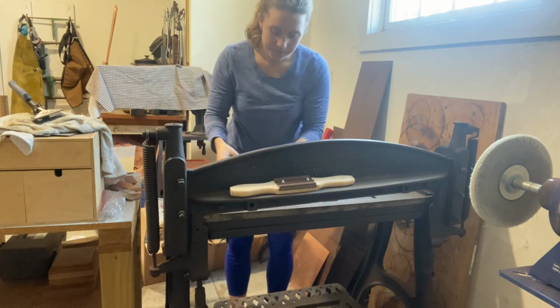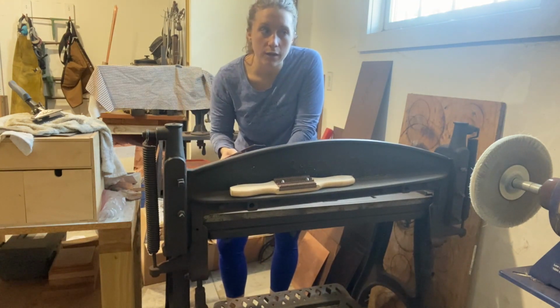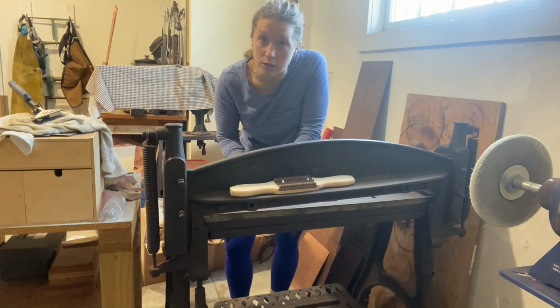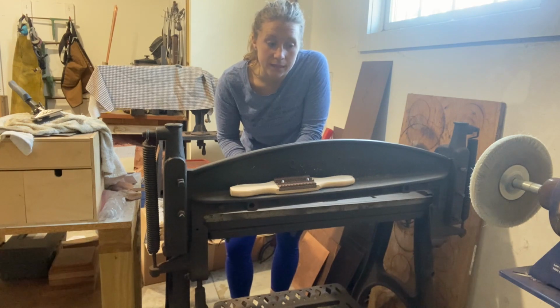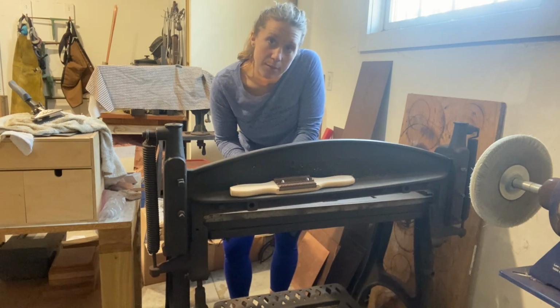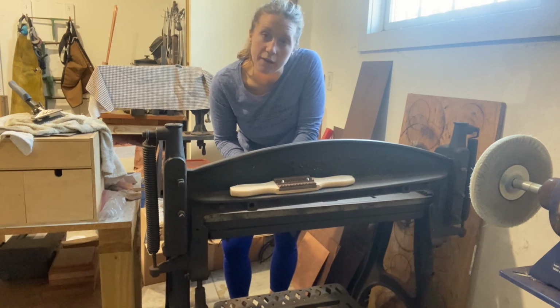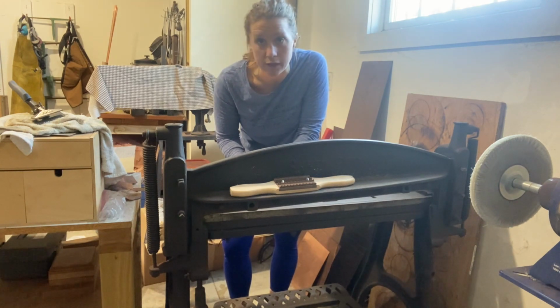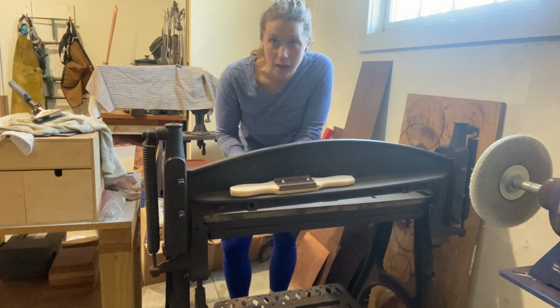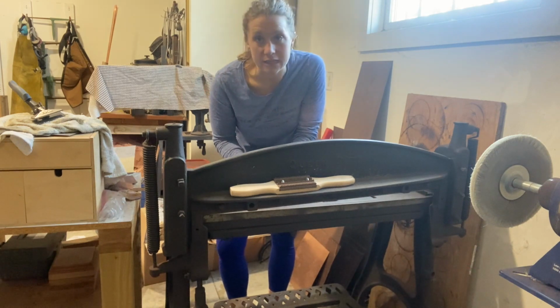This method is actually really good for any type of lid, whether it's for a mug, a coffee pot, a teapot, or a larger pot. This can be used for all diameters. Now, the larger the diameter, the more you're going to be fighting the material as you continue to work with it and as you continue to shape it. You're dealing with more displacement of the copper crystal structure, so there'll be certain times where it's more bothersome. These smaller ones are a lot easier to deal with.